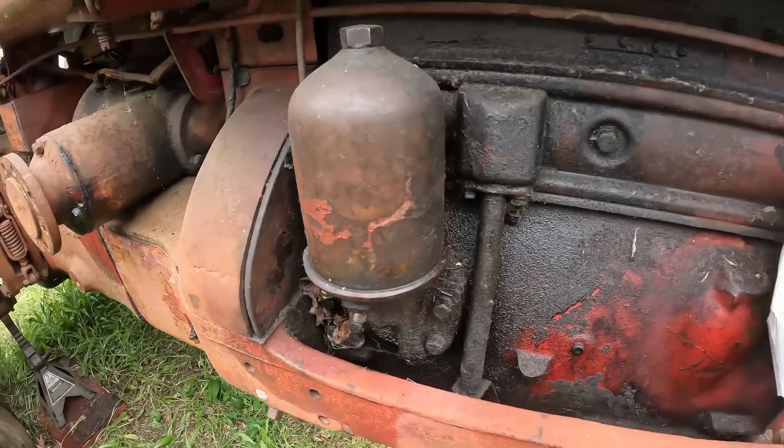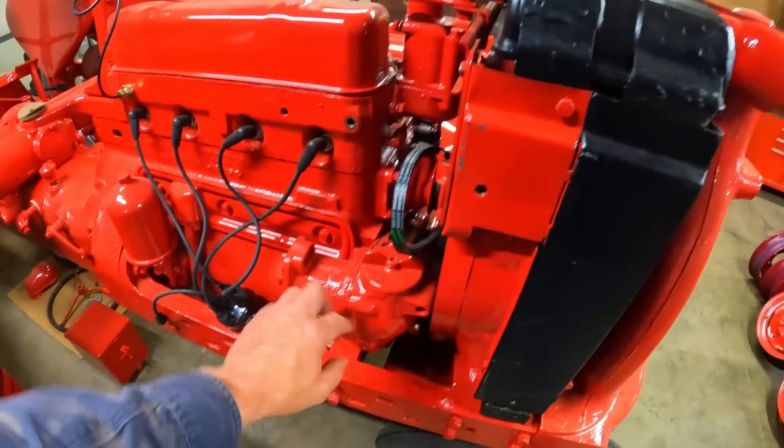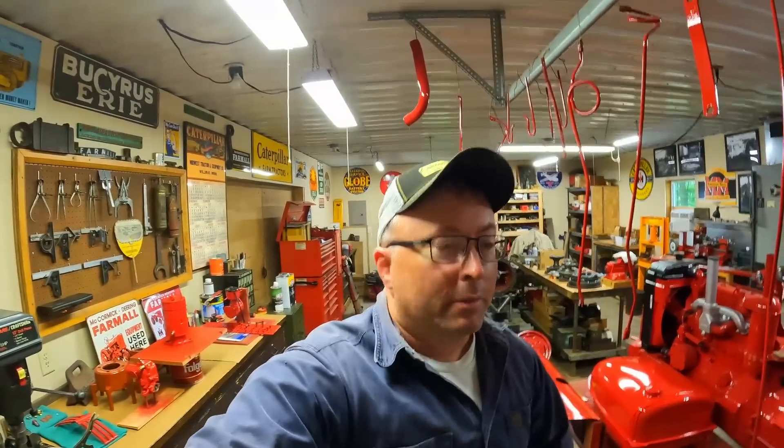As you can see, there are some different pieces at the back of the block where it anchors into the heavy cast iron tub — but these are not deal breakers. To recap: a quick front cover change with a new gasket — not that bad of a job. A quick rear adapter plate changeover — again, not that bad of a job, unless you get into the clutch and flywheel and find it needs to be reclutched. But you should be able to take that W6 engine and with minimal difficulty fit it into the Farmall M chassis.